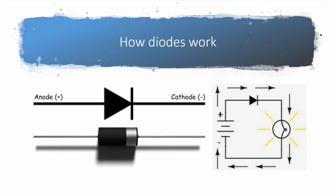But they put these diodes in there so that the diode can actually allow electricity to flow one direction and stop it if it's coming the other way. The easy way to remember it, if you look at this symbol I have here, that's real big, kind of in the center of the page, it looks like the play pause sign almost. You've got an arrow that points to the right. That's saying it would allow electricity to flow from the left to the right. And then you've got that solid vertical line at the end of that arrow. That acts kind of like a wall. So if your electricity tries to flow in from right to left, it's going to bounce off that wall and have to go somewhere else or just become a dead stop.